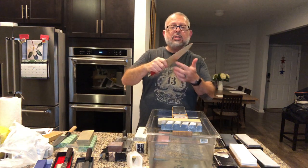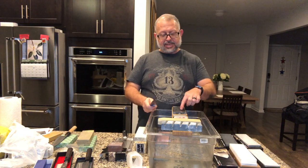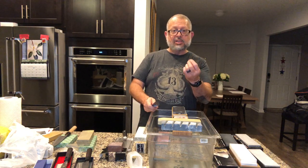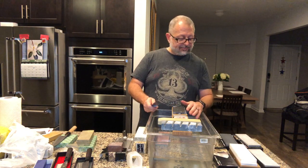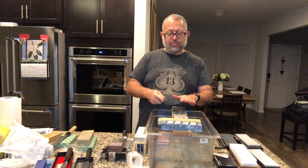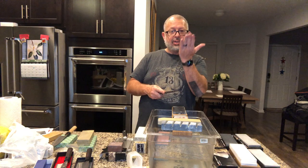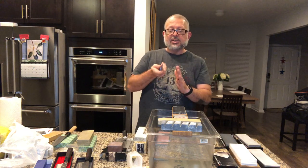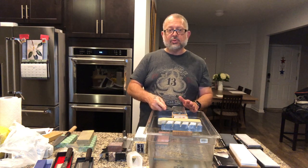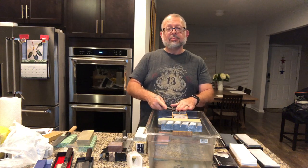You're making grooves. At a microscopic level, there are tiny dimples, conicals or whatever particles sticking up, rounded, and they make a form of sandpaper. You're making ditches in your metal. You hope that if you rub back and forth enough, you make an initial ditch and another one, and you keep flattening the ditches, and then you're making new metal. So you need to go back and forth, knowing that you're putting these ditches in here.